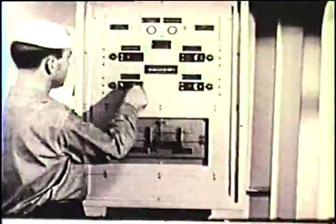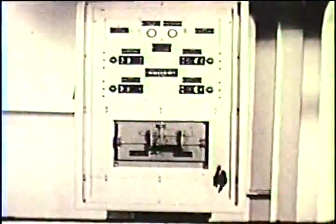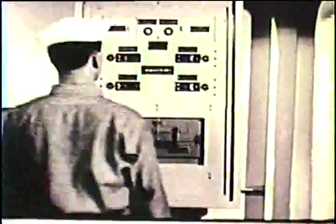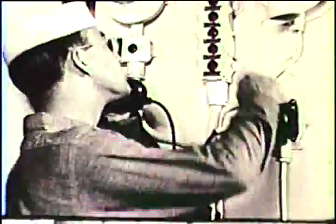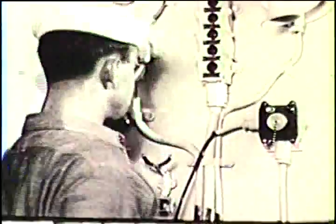The switches to the local propulsion auxiliaries are off. Turn them on. This should have been checked while preparing to get underway and before attempting to start the local propulsion auxiliaries. Now here's another condition. Both power indicating lights are out. The power panel is getting no power and naturally can supply none to the local propulsion auxiliaries. Call the ship service switchboards and get power to the power panels. This should have been checked while preparing to get underway.